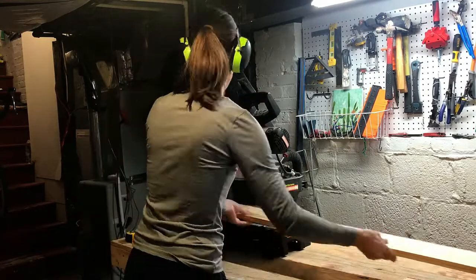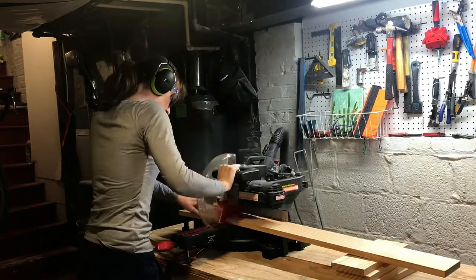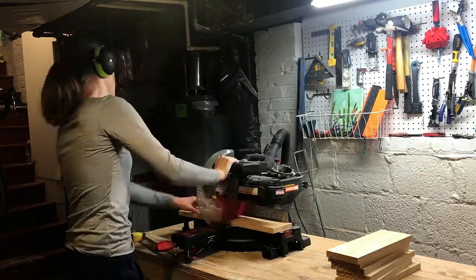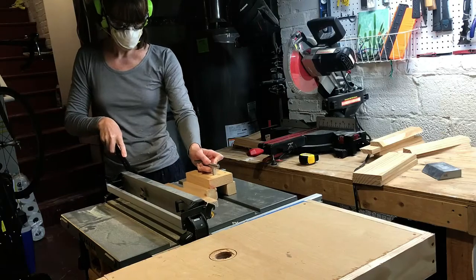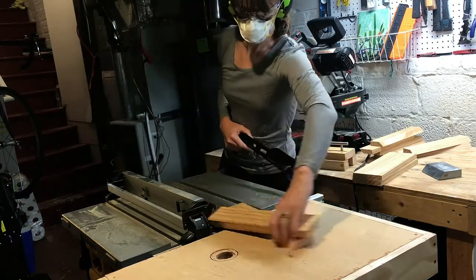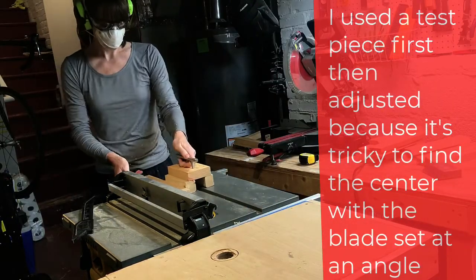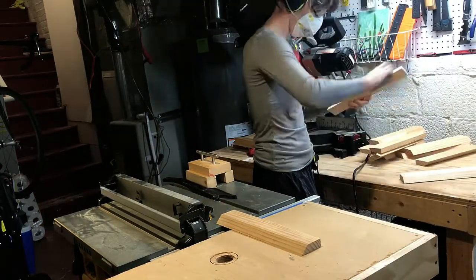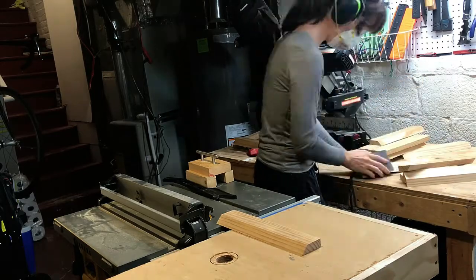I used a 1x5 to make my cleats and my accessory cleats, but a lot of people use three-fourths inch plywood for this. First, I cut the 1x5 down into pieces that were the exact size of the cleat wall space. Then I ripped each piece in half at a 45-degree angle on my table saw. I made a bunch of cleats this way — most attached to the actual wall, and the leftovers are what I used for the accessory cleats. There are other ways to make cleats, but this was the easiest and fastest way for me to make a bunch in my tiny woodshop.